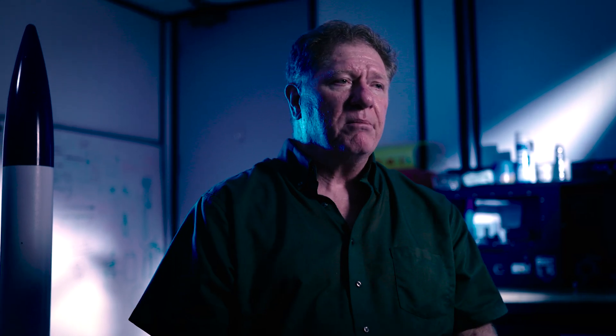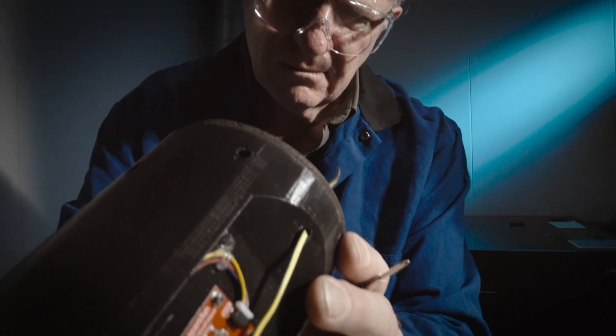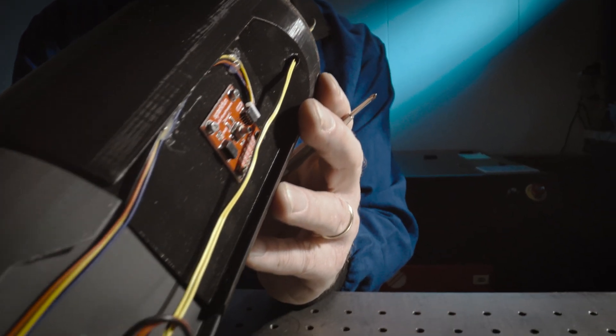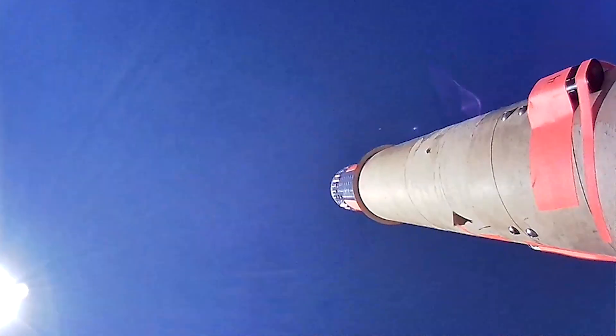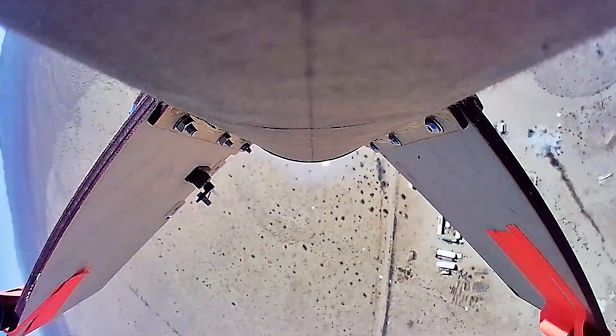The challenge became in testing. We had to develop a test campaign that we flew out in the desert, putting our motor in something that simulated a 3U CubeSat and placed that on top of a booster. The booster would fly this thing up and impart a spin as it went up — giving us the kind of spin we could expect from a 3U CubeSat on orbit. So we were essentially doing an on-orbit or zero-G test of this technology.